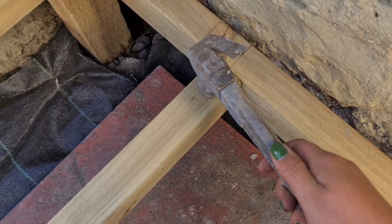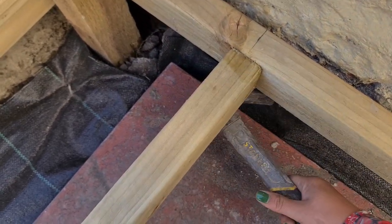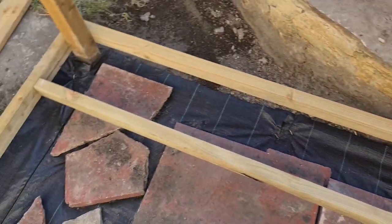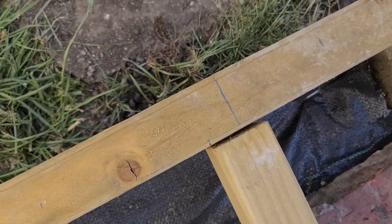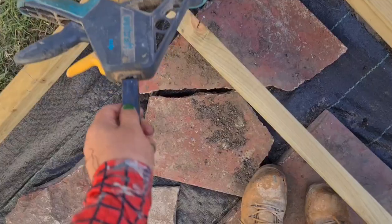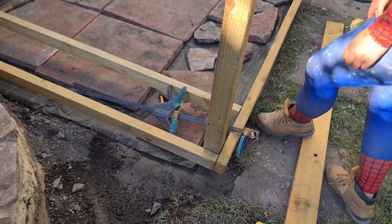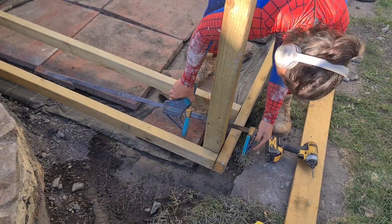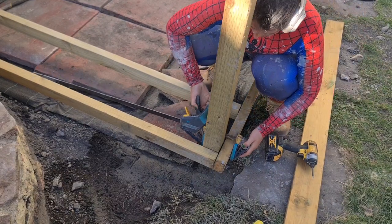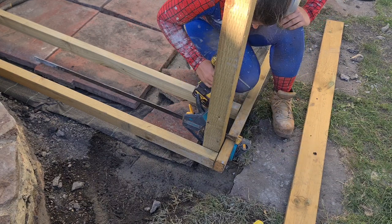Here's a little close-up of the tappy tap — just a little bit this way. Oh, that was too far. A little bit back. As well as making sure it's flush with the line I also want to make sure it's standing up straight and not wonky. You can see a couple of the real lines and the real real lines on the other side. Something also worth mentioning is that when I measured the distance between the two beams I measured from the centre of the beams — that way when I put these joists in they'll be an equal distance apart. I'm looking to get an equal distance between them, and since the central joists are measured from the middle, I do that with the external beams as well.